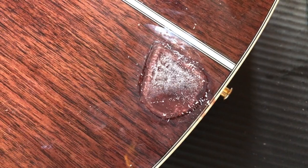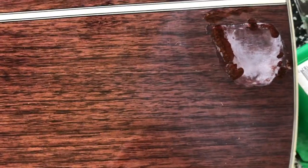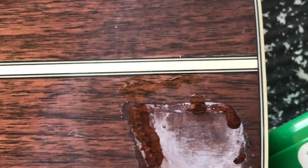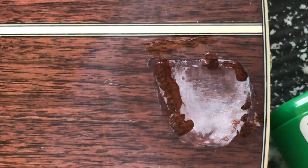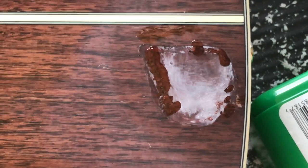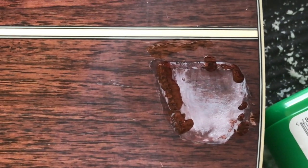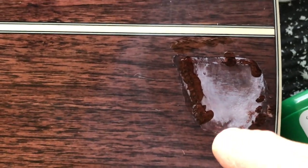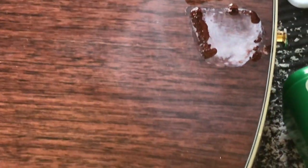Another delay. I brought it all down level - as you can see, the white is level. It had some little pinholes in it so I've had to put some more super glue and touched thin super glue into there. The next stage is to let it dry solid for at least two days. Super glue dries solid instantly, but it doesn't dry solid enough, so let it sit for two days. And I'll scrape it gently down to get rid of the pinholes. Then I'll sand it again because I sanded it with 600, 1000, 1500, 2000, and then 3000 grit. That will polish off now - that's the 3000 grit.